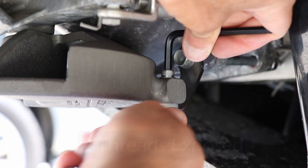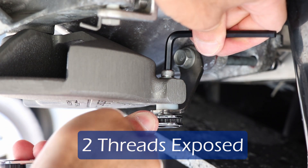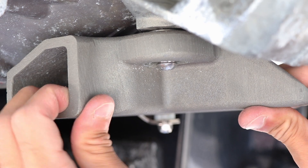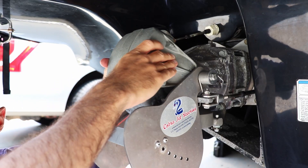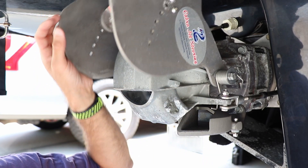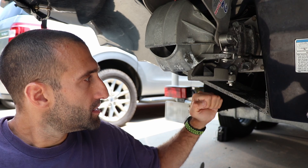Now go back and torque that bolt under the nozzle to 10 foot-pounds. Finish off the bracket bolt by tightening the lock nut to show two threads from the bolt. If we take our nozzle and move it side to side and flip the fins up and down, we can see that there is no binding — it's tightly mounted and not going anywhere.